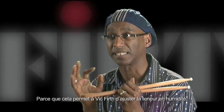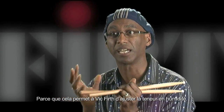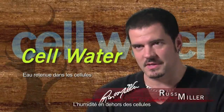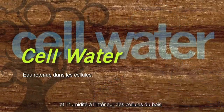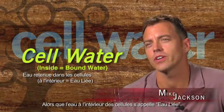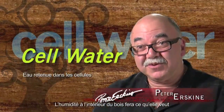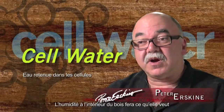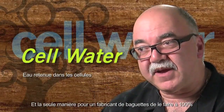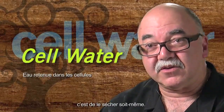Why? Because it gives Vic Firth the option to adjust that moisture content. There's two different kinds of moisture, the moisture outside of the cell and the moisture inside of the cell. The moisture found outside and between the cells is called free water. And the moisture found inside the cells is referred to as bound water. Moisture within a piece of wood is going to do what it wants to do unless you manage that. And the only way that a drumstick manufacturer can know with 100% certainty is to do the kiln drying themselves.